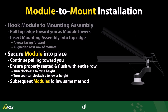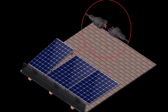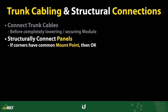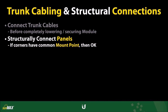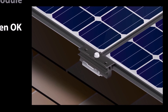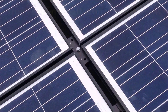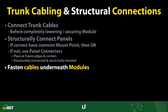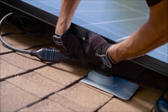Subsequent AC modules can be installed in a similar manner as the first module. However, be sure to connect AC trunk cables between neighboring modules before completely lowering and securing each module to the roof mounts. Adjacent AC modules whose corners sit at a common mount point are structurally supported and electrically bonded by the mounting assembly. If the corner edges of the AC modules do not rest at a common mount point, use a panel connector to join the AC modules together. Panel connectors hold the AC modules together structurally along the frame edges and corners while also bonding them together electrically. After cables and modules are connected, be sure to properly fasten and securely clip cables to the lips on the underside of AC modules.